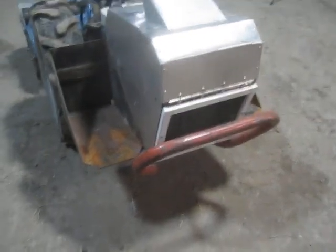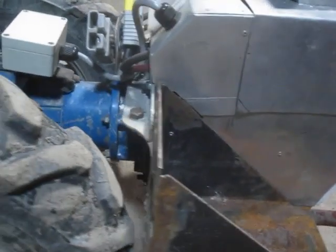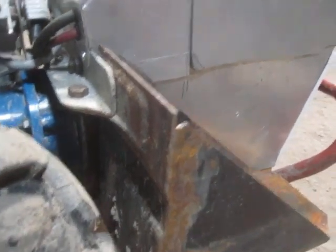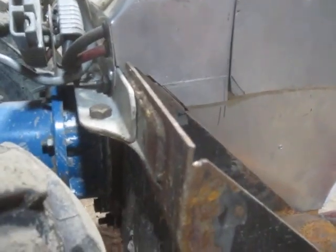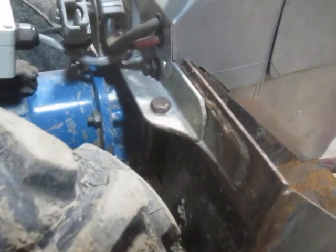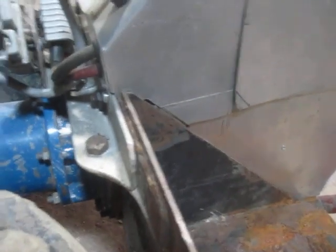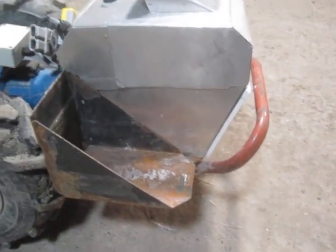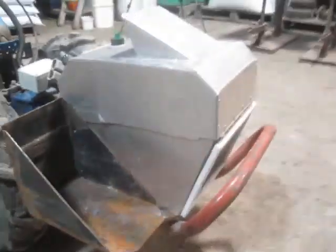The fabrication of the cradle parts took quite a lot of time because I was trying to get it as compact as possible — it's no longer than it needs to be. There's just clearance here for the front wheels. There's an adapter plate that allows the motor to bolt on to this cone where the clutch used to live inside, and basically my goal was to make something as compact and tidy as possible because the electric drive has the potential to be bigger and bulkier.